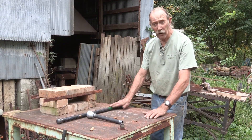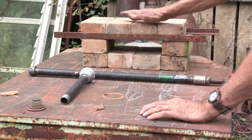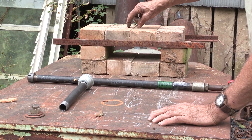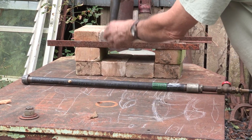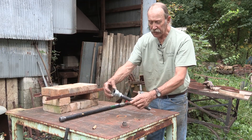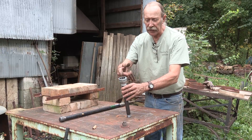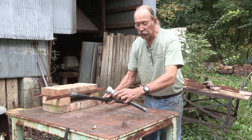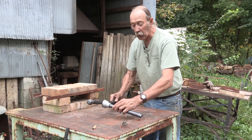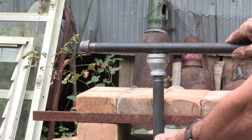What we have here are the parts of our propane furnace: some basic fire brick with angle iron to support the roof of the furnace. I'll be cutting a hole in the brick with a masonry saw so this pipe can be set down through the brick. On top of the blow pipe is a bell reducer — an inch and a quarter to three quarter inch bell reducer. We'll be grinding a hollow in it so that the pipe with the orifice, which is the gas release, can be tack welded onto the bell reducer and draw air in as the gas pressure pushes into the furnace.